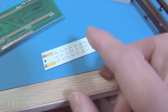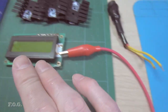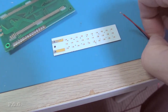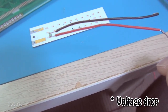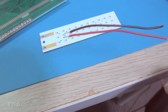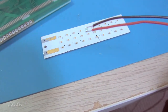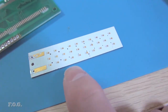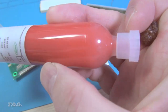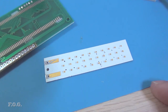I want to repair the backlight, so I'm going to use either green or white LEDs. White LEDs are around 3.3V, so I can only have one on a 5V supply. I'm thinking green instead, because I can serialize two of them, which should be more efficient. I'll use heat-activated glue to fix the LEDs in place, then do some fine wiring with enameled 0.1mm wire.